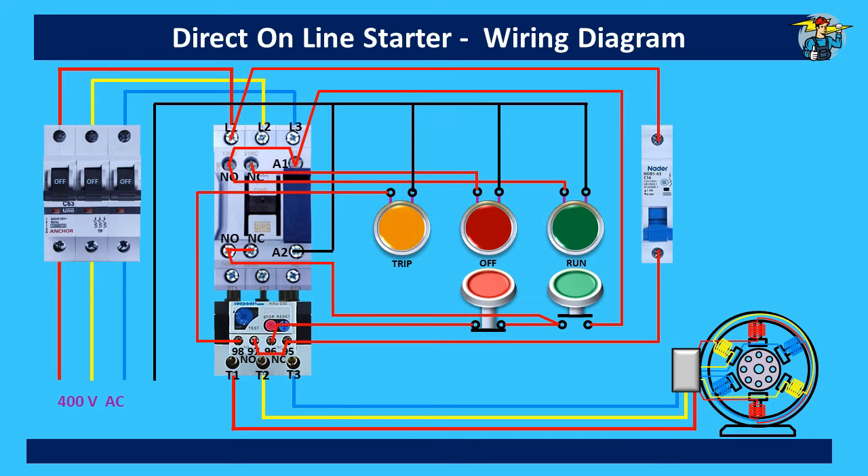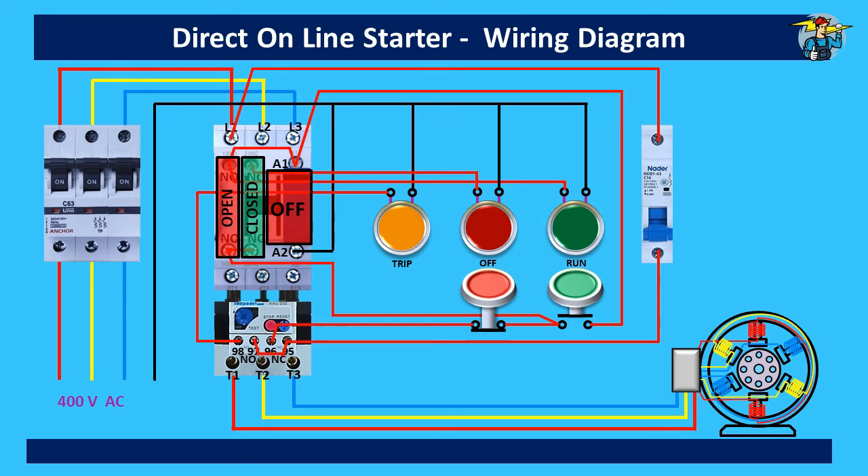Let's see how this DOL starter operates now. The contactor is at off position first, and the NO and NC auxiliary points are shown with red and green color respectively. The three-pole breaker is switched on and the main contactor receives three-phase power to its L1, L2, and L3 terminals. The control circuit MCB is also switched on and you will see the motor off indicator lamp lit up in red. As soon as you push and release the start button, the contactor is energized making the motor run. The motor off indicator lamp changes and the motor run indicator lamp is lit up. The NO auxiliary contact on the contactor is closed and the NC auxiliary contacts become open. To stop the motor, push the stop button once and release — the motor will stop with the contactor switched off and the motor off indicator lamp turns on.